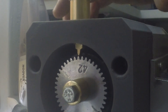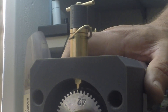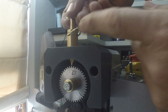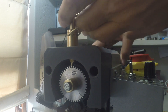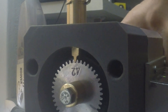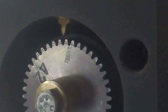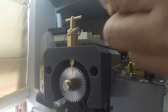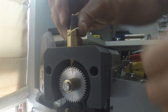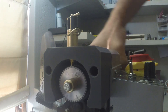The plunger and spring are inserted from above, and a two-legged pin is fitted into the slots of the lid as well as the casing. Lastly, the handlebar is fitted to the plunger. This is the thread-cutting gear used for indexing, with a spring-loaded plunger at the top. By lifting the lever you can remove the gray safety barrel, allowing the plunger to drop in between the teeth of the gear. By lifting the plunger you can rotate the chuck and drop it between the next marked teeth. Once finished, the safety barrel can be replaced and the chuck rotates freely.